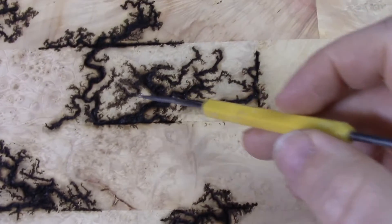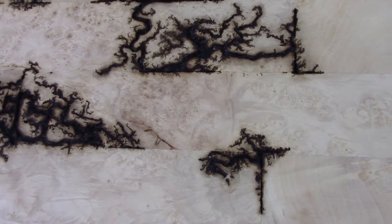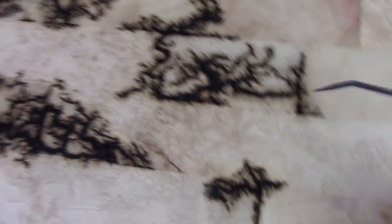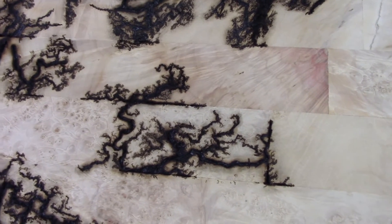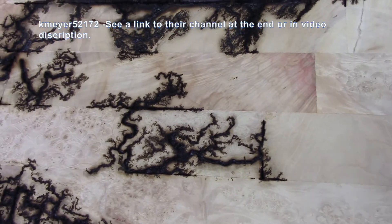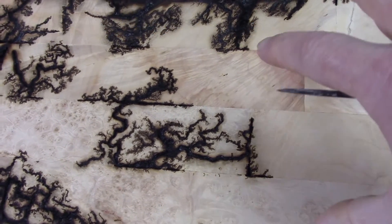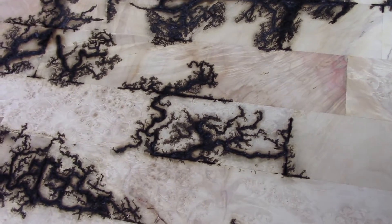This here, really more like this one, is what I got with just the lemon juice itself. I wasn't getting the long crawling arcs that I'm used to, so I added a little salt to the lemon juice and that's when I got this up here. There are two things we're trying differently: using the lemon juice itself, which was a suggestion by someone — I'll dig your name out of the comments — to avoid the greenish, grayish color that the baking soda turned the wood, which is really relatively unattractive. The lemon juice would leave the wood bright.